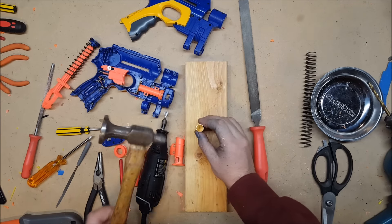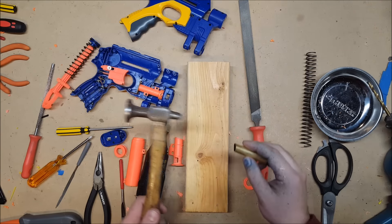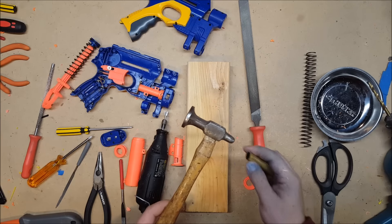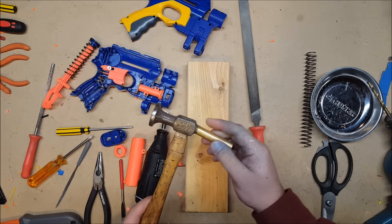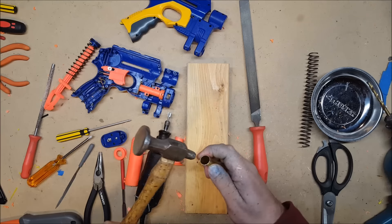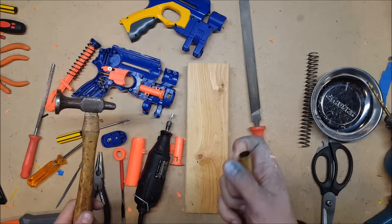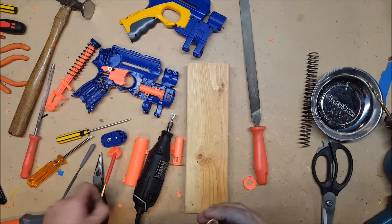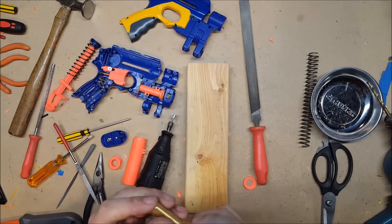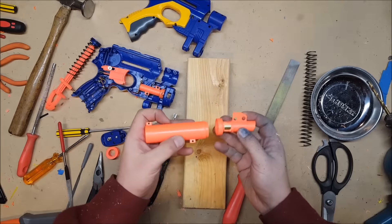What I'm going to do is flare the barrel slightly in order to make it a little bit easier to feed darts. I'm using this — a planishing hammer, for those curious about the strange-looking hammer. It has a very small ball-peen end that happens to fit brass quite nicely. Give it a few taps and it flares the end of the barrel just a little bit — just enough to make it easier to feed a dart in, but not so much as to make it not fit anymore.